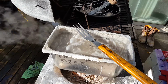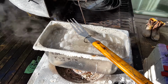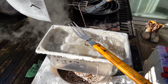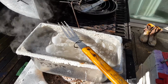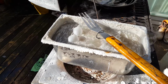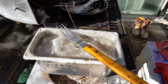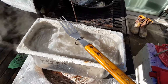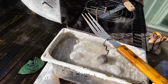There's other stuff they put in there to make the colors, because actual hot bluing comes out pitch black, just like your M92. If any of you have them out there, they're black. They probably glass beaded it and then threw it in the hot bluing, and it comes out black. I'm sure if you polish it up real nice, you can get a bluish hue to it, but for the most part, bluing is actually blackening unless you put other stuff in the mix.